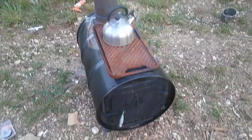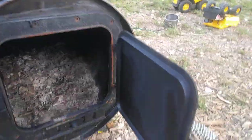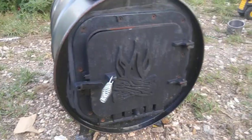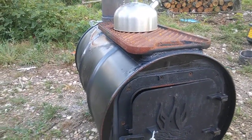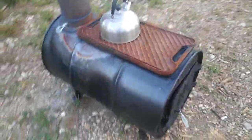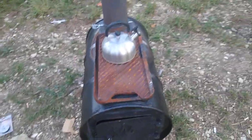Just want to give you an update on my wood stove I got going here. I got a griddle on top — just a 30-gallon drum I ordered online. I'm going to be putting a gasket in there and lining it with some fire brick. If you get the 30-gallon drum, you're going to need to modify it a little bit because it doesn't fit. I took some high-heat mortar caulk, caulked that griddle on, caulked the flue collar, and over here — if you can see it — there was a gap on the legs so I caulked that too. Once you heat it up it turns to a rock, so it's not going anywhere.